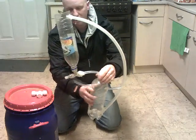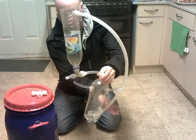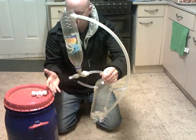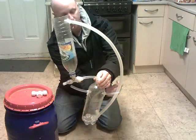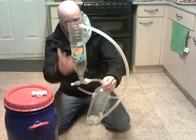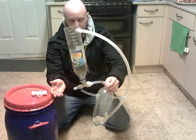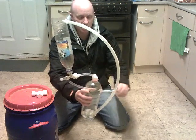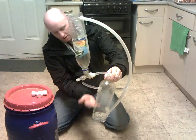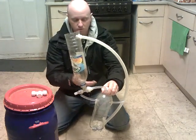There will be a valve on there, a valve on here as well, and also a valve on this bit. So the gas comes in, all valves are closed apart from the one here. This will be full of water, so as the pressure gas from the biodigester comes out, the water will be pushed out the pipe up into the top one. I've blown down this and it does work — the water does go up to the top. This fills with water, this fills with gas. When it's full I can shut the valve off from the biodigester, open the valve for the gas release, open the valve for the water to come down, and as it fills up the gas will be expelled out of this outlet to a gas stove or cooker or whatever I want to do.